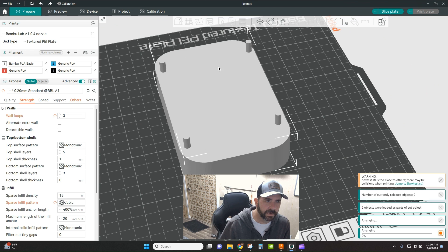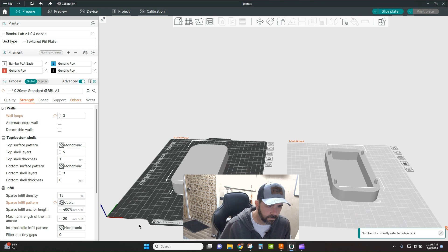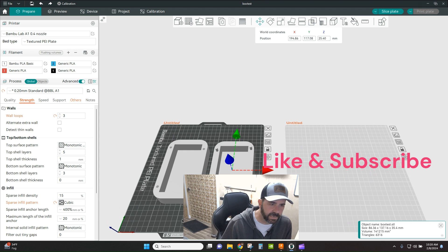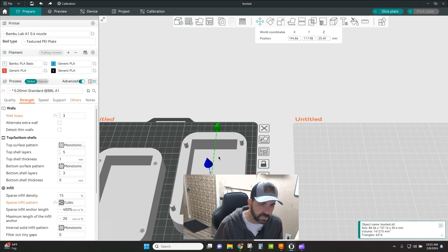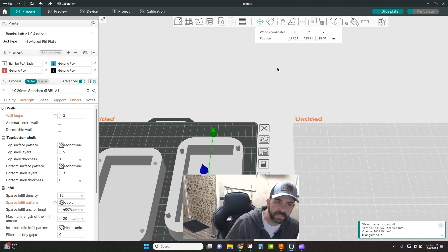After auto arranging, if we flip this over you can see we've got plugs on one side and a reciprocating hole on the other — print these out and stick them together. Is this meant to come on and off repeatedly? If so, you want good surface area and strong walls — maybe even print those solid for added strength, because with layer lines it's going to be a pretty weak connector. But from an alignment and accuracy standpoint this is great, since the pins only go in one way and the part fits together correctly.